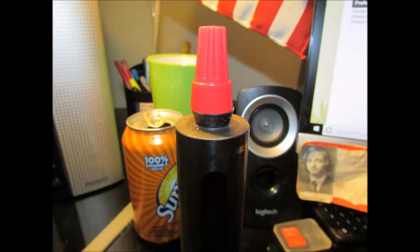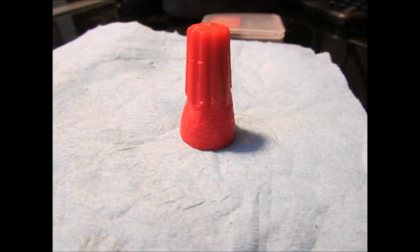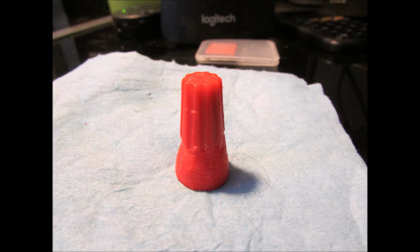And just to reiterate, on the upper part of that smooth bottom taper is the collar I'm talking about. You have to cut off. Here's what it looks like after I did it with the Dremel and a razor knife. You have to do that to get the bottom tighter, smaller diameter of the seal to go over that and into place, like I've described.